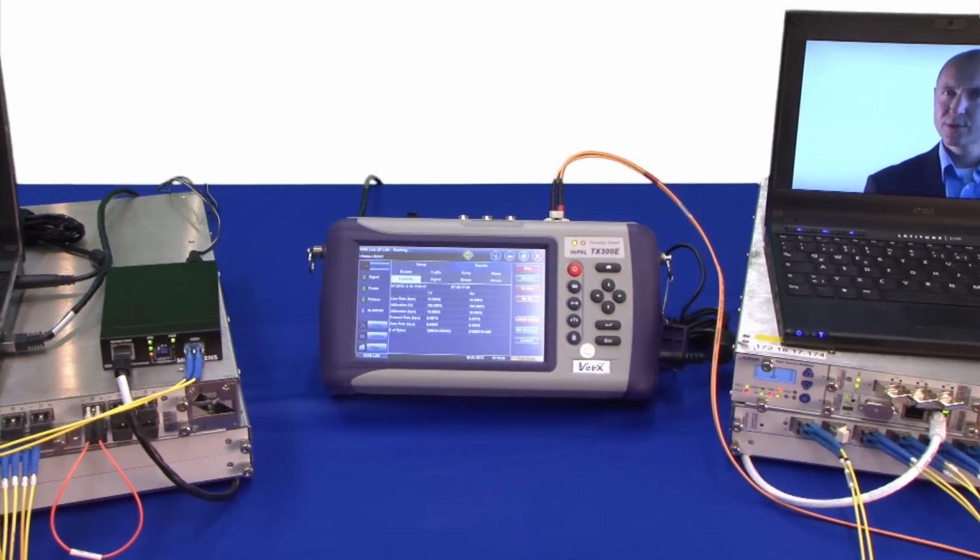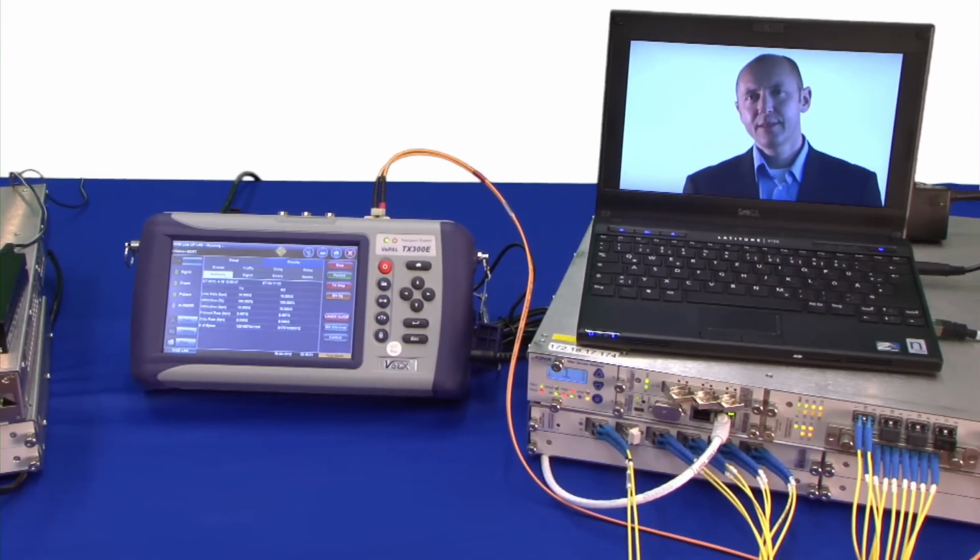Now, it is important to remember how power efficient this card is. 100 watts for a fully configured 100 gig card. 100 watts for 100 gig. That's less than 10 watts for 10 gig service. Less than 1 watt for 1 gig of transport. These figures are amazing. Remember, once you plug in this card, you have 2.5 times better spectral efficiency on your fiber plan than with existing 10x10G solutions. Think for a moment how this will extend the lifetime of your infrastructure.